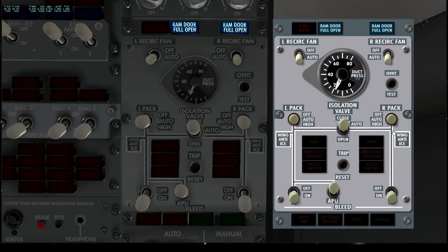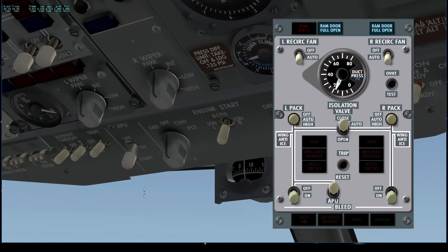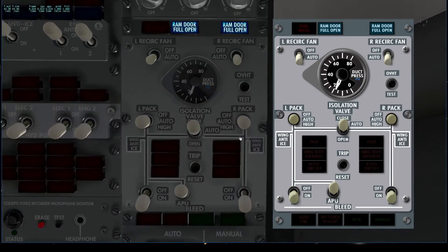I'm going to see if I can start the APU. We'll go back to the panel and I'll show you a few other things. All these things are controllable on either panel and they respond. There are the recirculation fans — they recirculate the cabin air. When you turn those on, it requires less bleed and gives you better fuel economy. Although a lot of people feel that when those are operating, the air gets stale and viruses get passed around in the cabin. So oftentimes on long flights, we would turn the recirculation fans off.